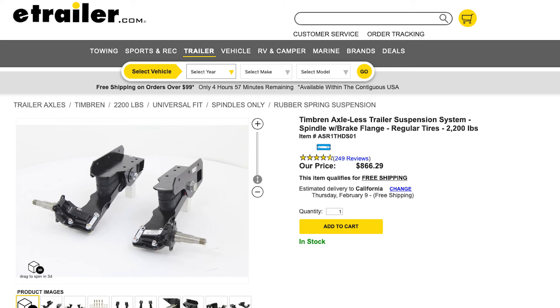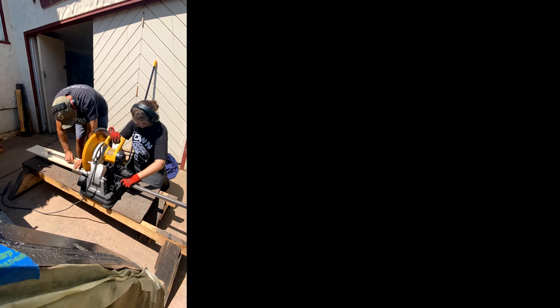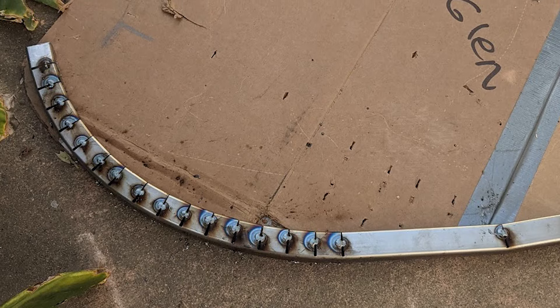Once the base was done, we started building the steel frames for the sides using a full size cutout cardboard template that guided how we curved the metal tubing. We made pie cuts along strategic spots in the tubing to allow for easy bending and then welded those cuts on all sides to keep them in place along the curve. We started conservatively with how many cuts we needed and then added more later to get closer to the template. We used the same method for the curved corners of the frame for the side doors. To ensure both sides matched, we welded one according to the template, made sure everything was looking right, then took the second piece of tubing, made cuts in the exact same places, and bent it following that first one — clamping and welding as we went — just to make sure the metal wasn't overheating and warping.